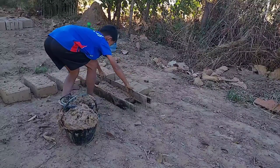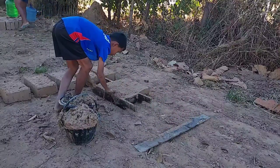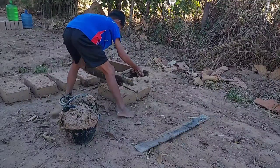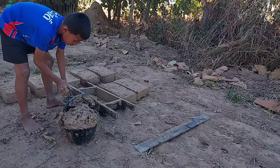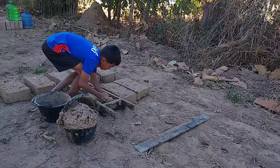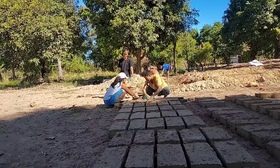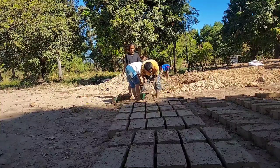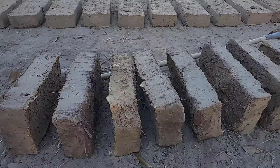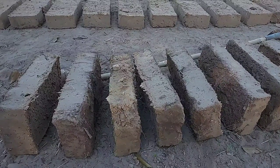If we have a few people working together, it's okay to use a single mold like this. But if we have more than 10 people, our mold can be double or triple. Any size is okay, so we don't need to make a lot of molds — just one like this is good enough for a few people. Kids are very good labor for this part because they have a lot of fun. All kids love to play with mud. Today, six of us can make only 500 bricks all day, but the next day we will make more because the first day is always slow. After the bricks are ready, we let them dry for one or two days and we can turn the side up like this — it will dry a lot faster. This side of the brick is 4 by 8 by 16.